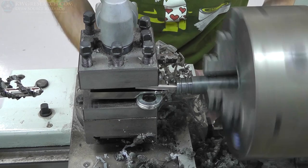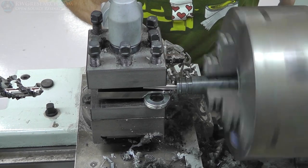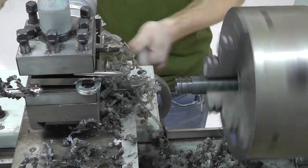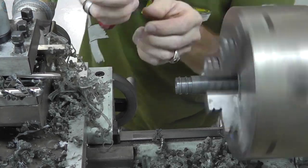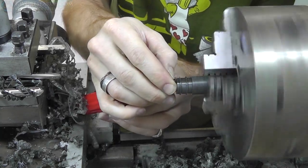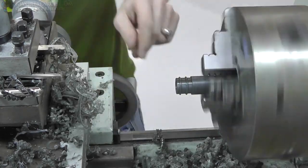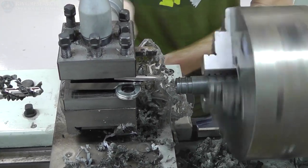Now let's get back to that thing I told you about earlier. Shouldn't use hand tools and things like this. So I was taught not to do this because you could potentially get your hand in the chuck, and well, that's spinning pretty fast, and it's a big giant chunk of metal, and your skin is just skin, so it's not anything against that steel, especially spinning at this RPM.